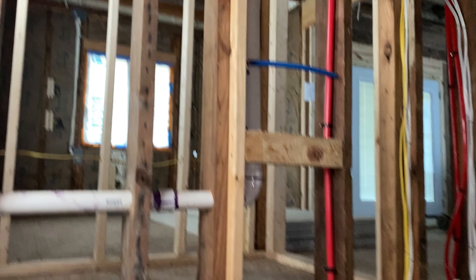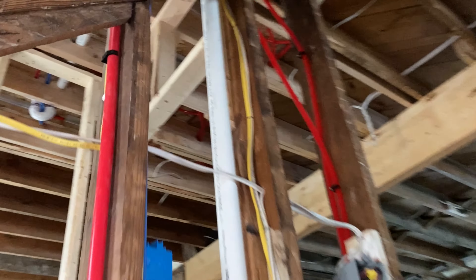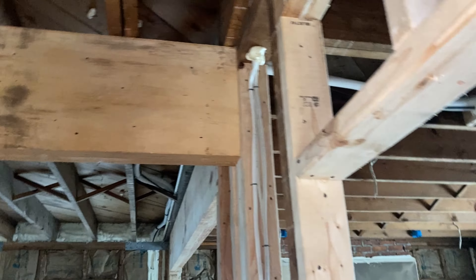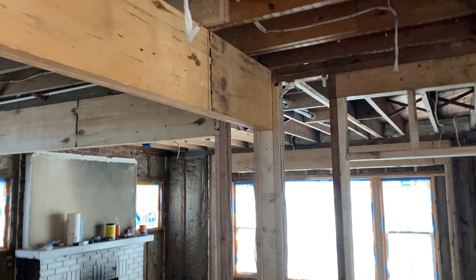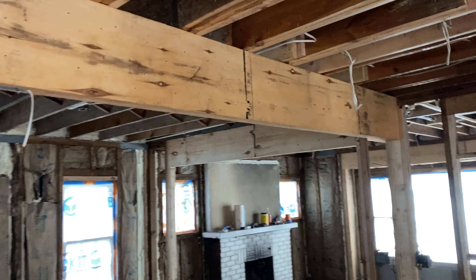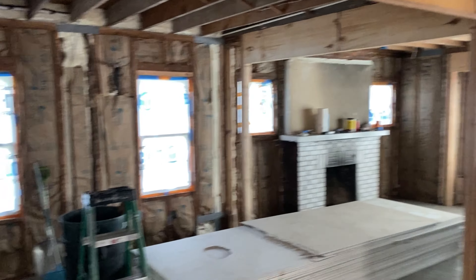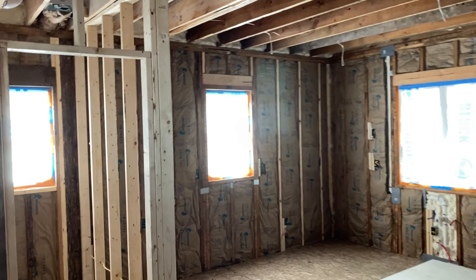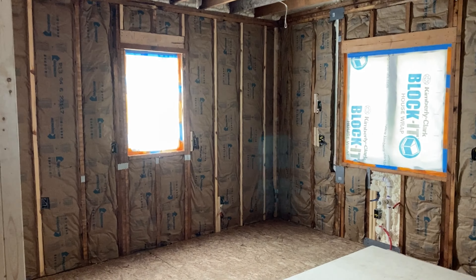Here's some of my plumbing and electrical. Lots of new and improved framing - a couple walls we knocked out and put big LVL headers in. This was all very closed up: small door here, small door over there. We knocked out a lot of walls and added this little powder room. We're all ready for drywall.